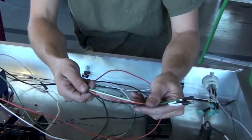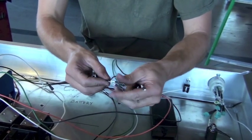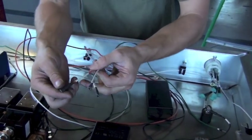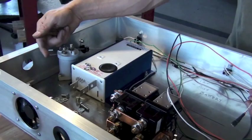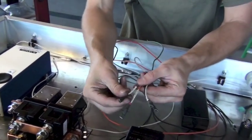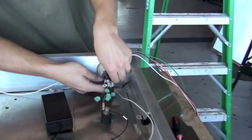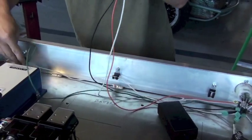Next we install four wires that follow a common path inside the high voltage control box. Two wires terminate at the controller, one at the reverse relay, and the final one ends at the opening at the back of the control enclosure where it will connect to a wire from an incoming cable harness. Route them together through the wire stays and runs on the back of the box, starting near the charge plug and running across. The green wire terminates at the reverse relay in the corner — leave that there for now.